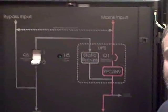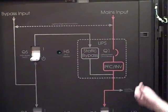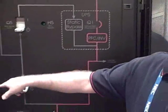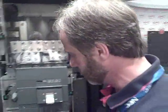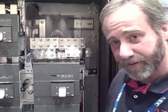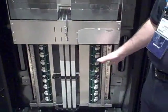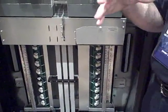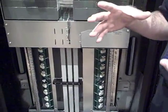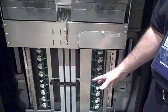This is a native 480-volt system — 480-volt in, 480-volt out. You have your static bypass, maintenance bypass, and output breaker. The Q1, or main system input breaker, is on the front. We've also configured this with a three-phase 480-volt sub-feed panel. This is a very robust design where you can start demarcating parts of the data center and parts of the distribution based on the sub-feed distribution breakers.